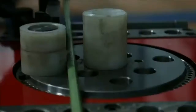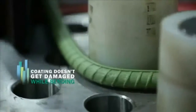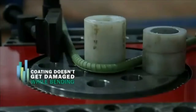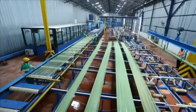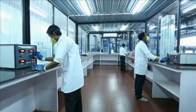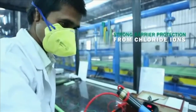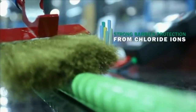Because of flexibility, the coating does not get damaged when the straight bar is bent during fabrication on a special mandrel. FBE acts as an insulator for electrochemical cells and offers a strong barrier protection to steel, which prevents chloride ions from passing through it.